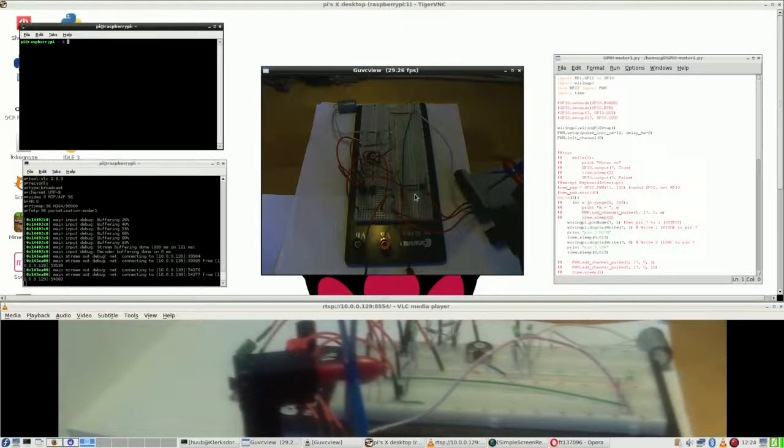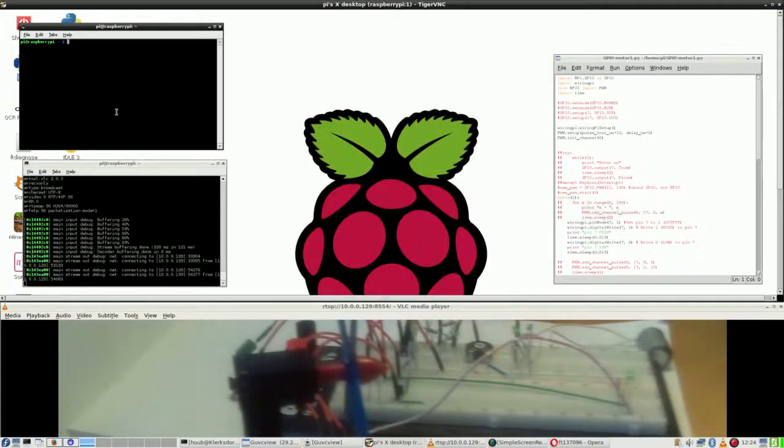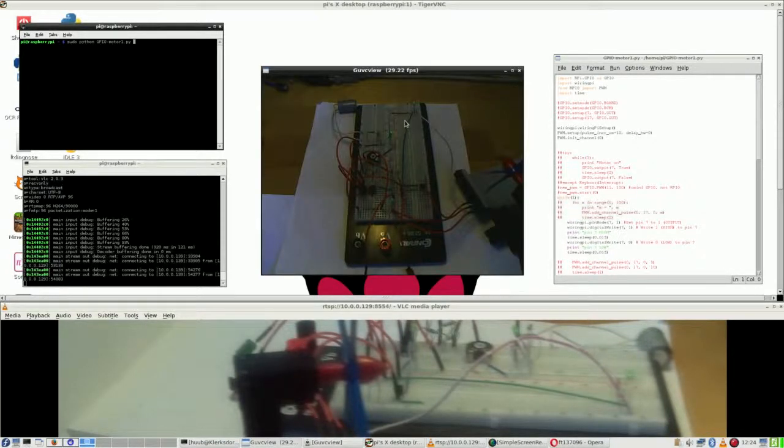Last time I also found that when I apply pulse width modulation, and as you can see the program isn't running at the moment, this program, so there's no flickering. So why is the LED on anyway? Because of this wire that I put alongside this op-amp, operational amplifier, with a wire to this LED.